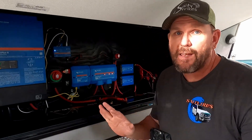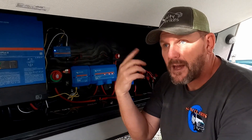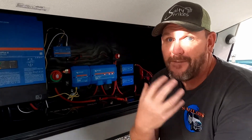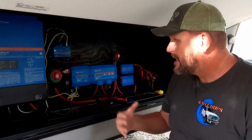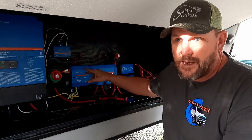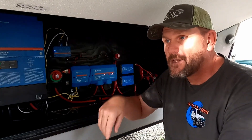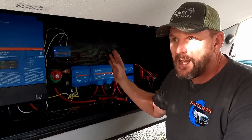So I went on for about four, four and a half months and everything was working perfectly fine. Then all of a sudden, out of nowhere, the battery stopped showing on the Cerbo GX again. I kind of forgot about the whole situation from a couple months ago, so I went and saw the orange blinking light and Googled it — and found my own searches, my own questions, because apparently there's not a lot out there. So I just did what I did last time, reinstalled the firmware, and it started working again. About two or three days later, it went blinking orange again. I installed it again, and then about two hours later, same thing. I reinstalled the firmware again, that lasted a couple days, then it went out again.